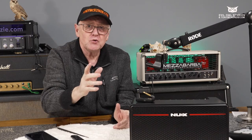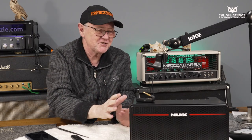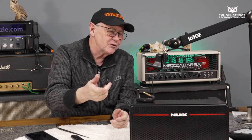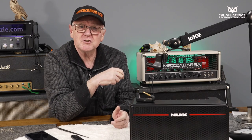Now, if you noticed earlier, this is another like. I can't guarantee for you that this is the case, but I'm sort of reading between the lines. You'll notice that at one stage it was talking of up to 50 watts output out of that little chip. Well, it was at 2 ohms. Now, I can't tell you that you can plug a 2 ohm speaker into that speaker out and you'll get 50 watts out. You might. It's in the specs. But can you do it? Well, the manufacturer says 30 watts, so you can be pretty sure that you're going to get 30 watts. That's the main thing. I couldn't really tell you more about that, but you conclude what you like. I haven't seen anybody else talk about that at all.